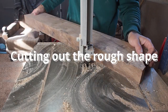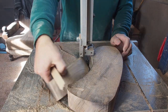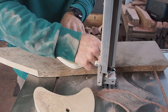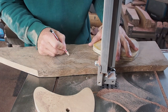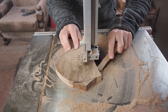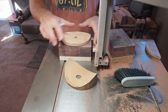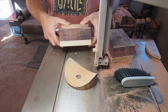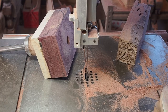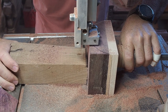Let's start with cutting out the rough shape on the bandsaw. Sometimes I come up with a new shape — in this case it's going to be a big walnut pinch. But often I use templates to outline the rough shape. These templates were copied from previous shapes which turned out decent enough to be replicated. For some holds I use multiple templates. This block of purple heart, laminated on top of ash, is going to become a small sloper. I am using the mounting rod of the carver's vise here, which enables me to make cuts that would otherwise be too dangerous.